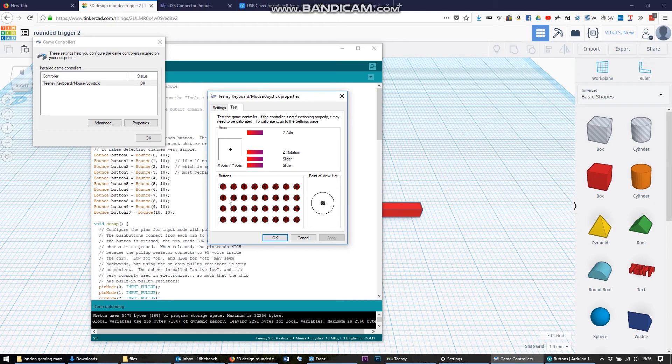We have 11 buttons, but I need 12 to match the SNES, so I'm missing a button. The 12th button — select — is going to be handled by a capacitive touch button that's going to be in some obvious place on the Game Gear where you can hit it when you need to. But yeah, I'm really pleased with this. The button switch plates went in really easily, just a few iterations to get those working. I wired the Teensy up and that all worked first time without any changes.